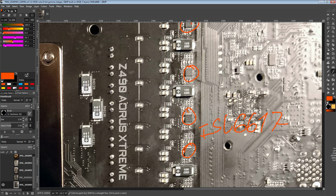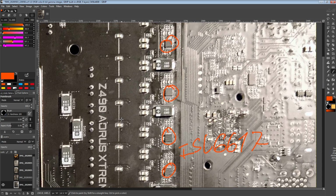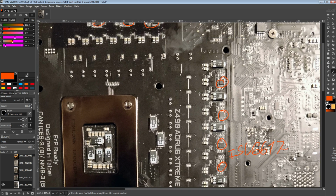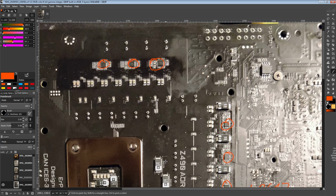The reason running the power stages synchronous gets you better transient response is not really so much from the pulse extension. It's because your inductors end up in parallel, and so you get half the inductance for your phase, which gives you twice as much current slew rate. So, these are pretty cool doublers, and I'm going to assume that Gigabyte's actually running them in the 8-phase configuration here.